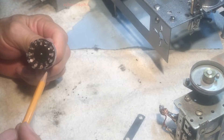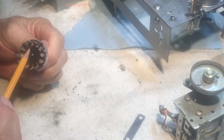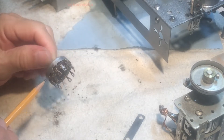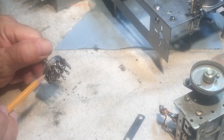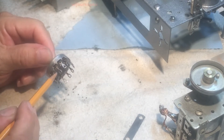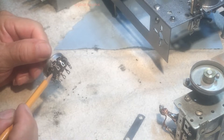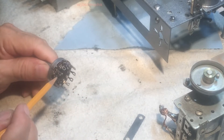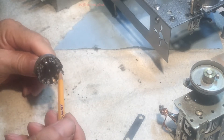One wiper would take care of three lugs on the outer rim, and the same for each of the others. Well, this one is pretty much like that except there are no lugs that come through for wiper connections. These are on the shaft, so all it is is a shorting bar that goes between the base. You can see I've got marks there, there, there, and there — all 90 degrees apart from each other — indicating that this lug right here is the center lug of the three.